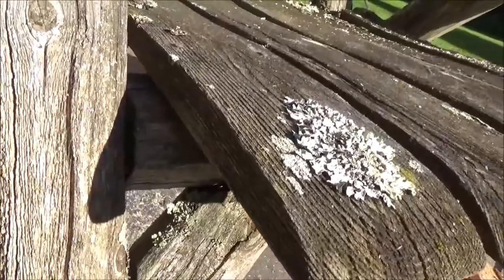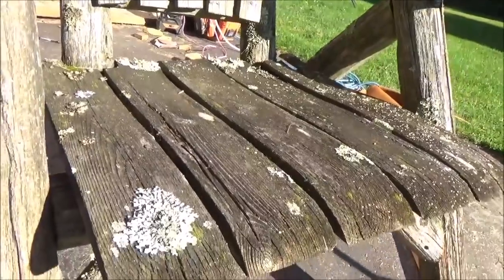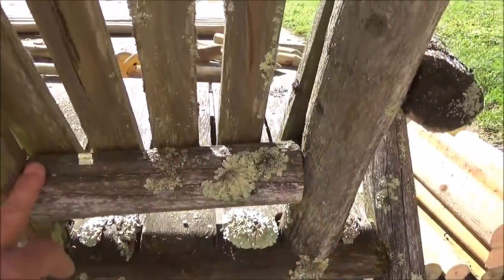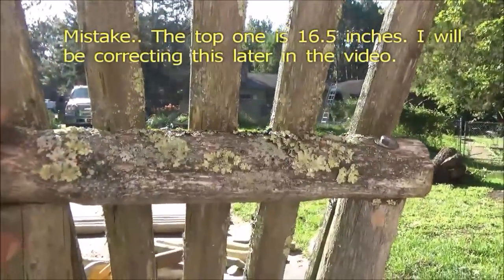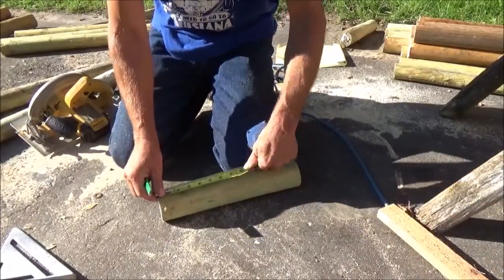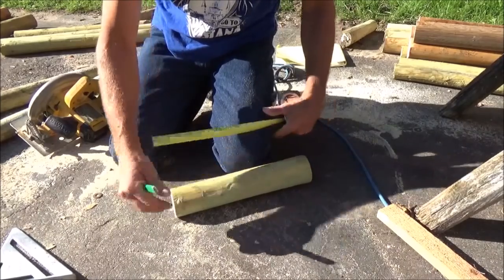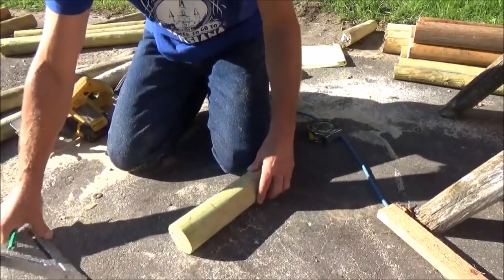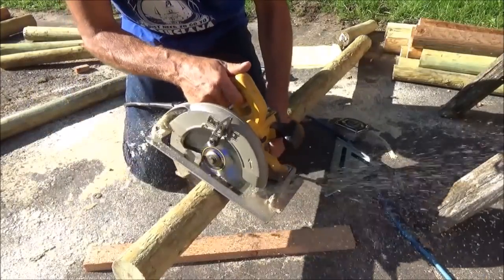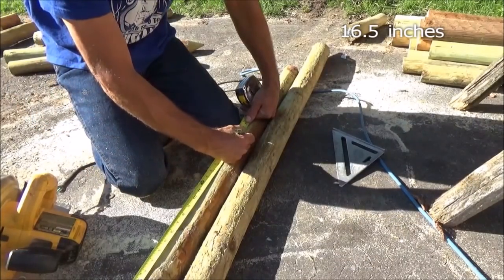Those four that we just cut — two for each chair — are these ones right here underneath the seat. There's one on the front and one on the back. Next on my list is this one here: nine and three quarter inches. And then this one on top here, which is another 20 incher. So this is the lower cross piece — that was nine and three quarter inches. Now I'll cut those two top pieces for on top of the uprights, which is 20 inches.